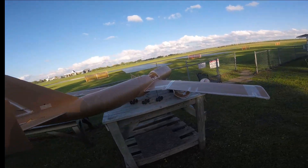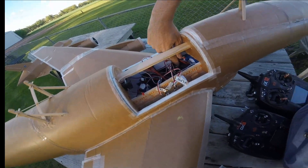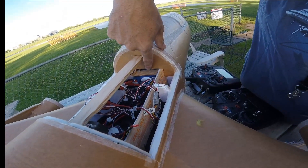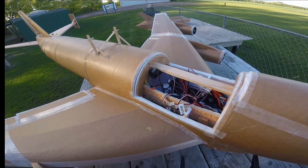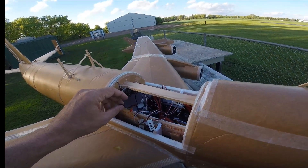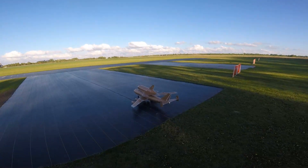Inside we've got a 3D printed mounting bracket actually holding aluminum tubes embedded into the wings, holding everything together. The wings are just held on by a screw through each piece of aluminum tube. I've got four 4S 4000mAh batteries located up there — I can put four more in, however I had an incident with one of my other planes that totaled one of my eight batteries, so we'll just do a shorter flight with four. There's also a 2S LiFe battery powering the receiver.